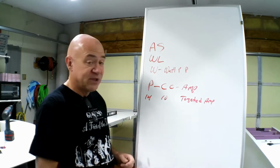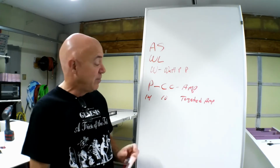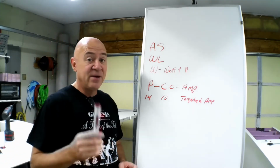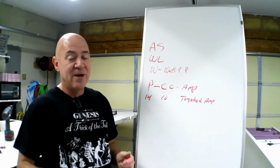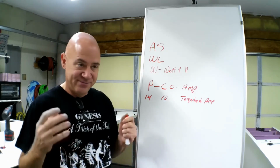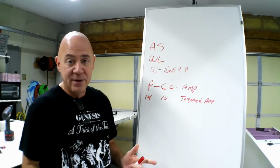Now, higher pitch props, for me, have made a complete difference in the way that I power my airplanes. If I could buy 16 pitch props, I would. I made 6-bladed 16 pitch props out of carbon fiber and tested them out, and they were awesome, except they were a horrible bitch to make. The man hours and labor and just the precise bullshit time it took to make them work killed me.